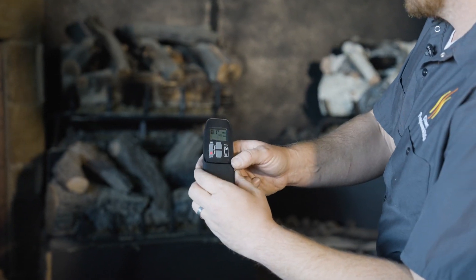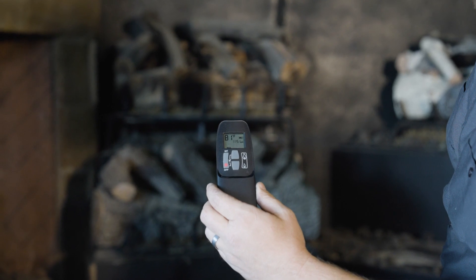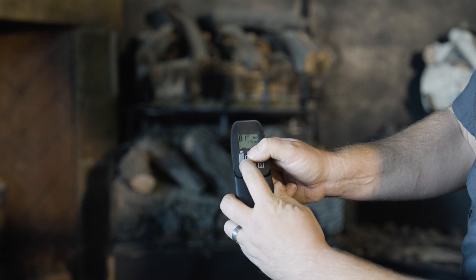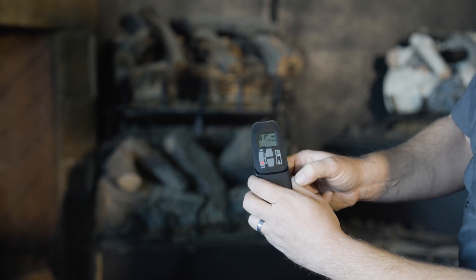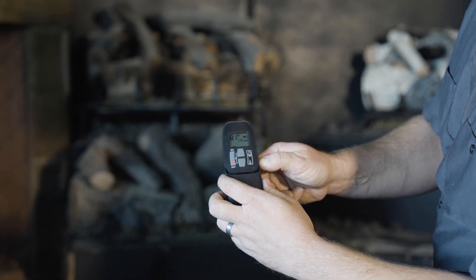This issue applies to the G19 burner system and the RealFire G10 burner. If you take your remote and you hit the two buttons to initiate the ignition system and you're not getting anything, or you're getting a real long beep, that's a good signal that you need to replace your batteries.